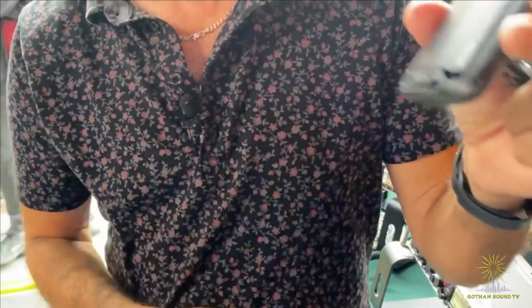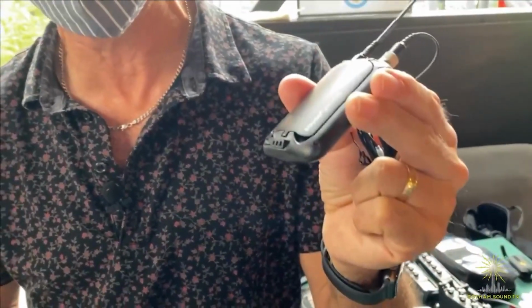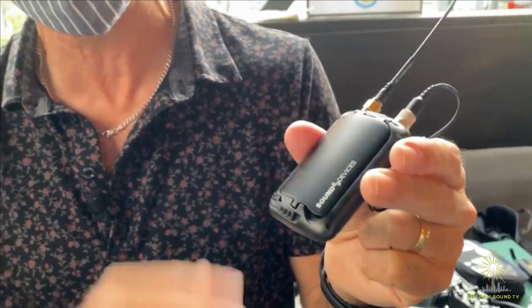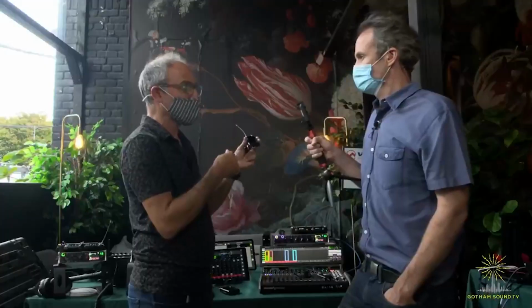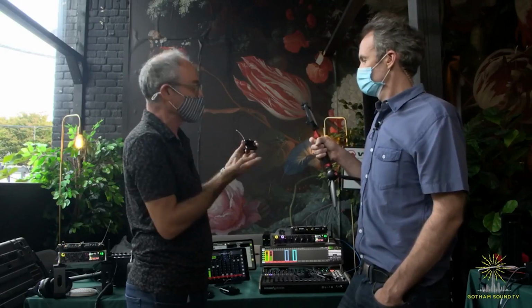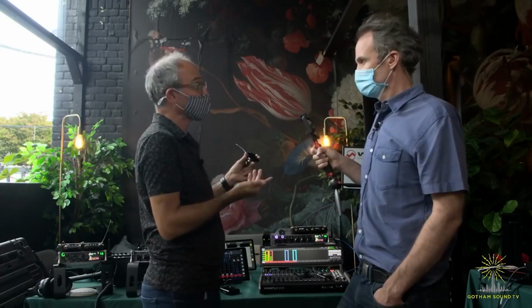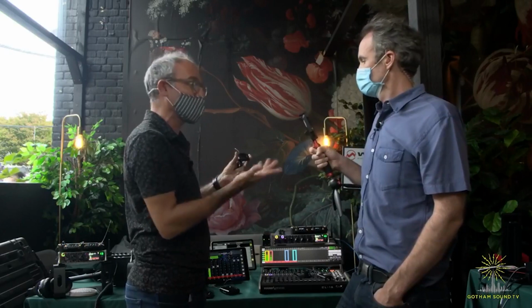And one of the nice things about this is it's wideband. One transmitter covers 470 to 694 megahertz, so the whole range. You don't need to worry about what you're going to hold in inventory to cover the full spectrum. And obviously with crowded spectrum these days, having a transmitter and a receiver that can cover 470 to 700 is a big bonus in terms of planning your inventory.